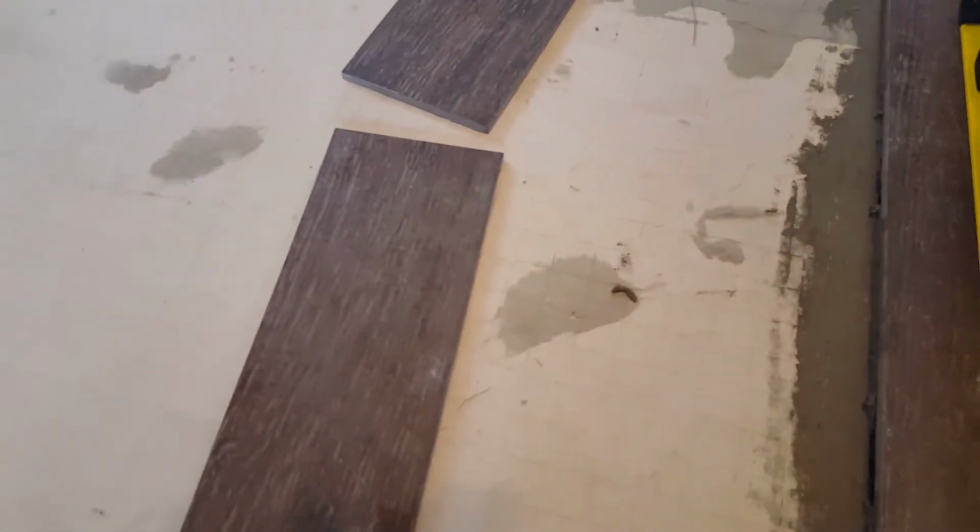All this along the edge here, I want to drive that in underneath. Kind of a two-hand operation. Keep your edges clean. If you get thin set on the top of your tile, you have to scrape it off later, which is not nice. I know other tiles are going here right away, but again, keep your work area clean and then your tiles will stay clean and you'll be happy later.